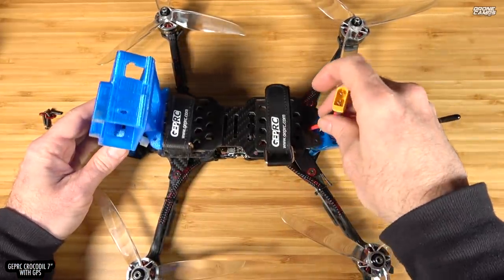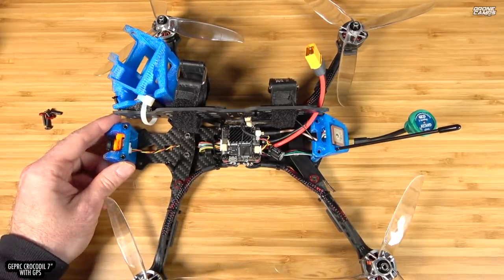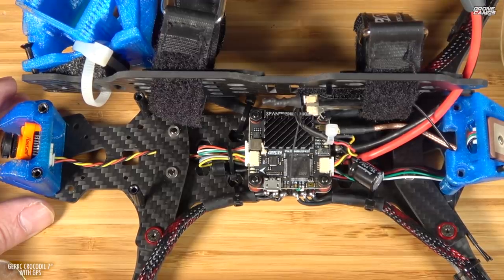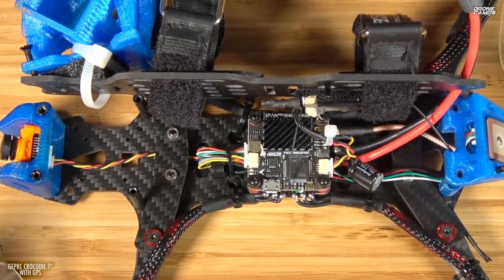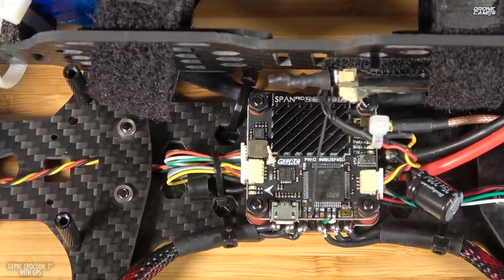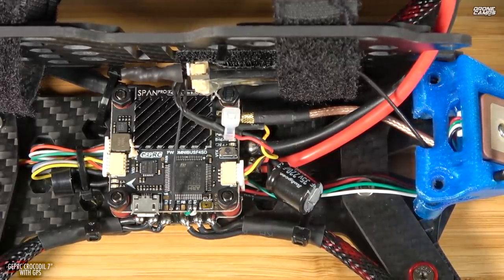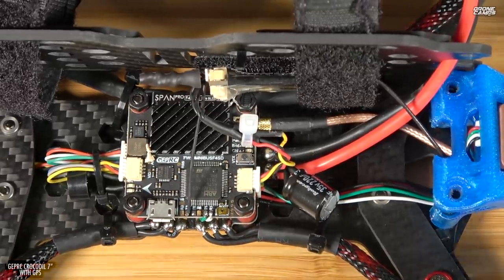I have six bolts on the very top of this top plate that I removed. I'm going to push this back so you can see the F4 SPAN — let me zoom into that. This is a very simple layout, two-layer stack which I love, 50 amp ESC is great. Everything is also plug and play in here. You've got that single wire lead going back from the camera — that plugs in as well. If you need to replace the camera, all you have to do is plug another one in. Same thing with the GPS — this is the GPS wire lead here coming from your GLONASS GPS, it just plugs into the flight controller.